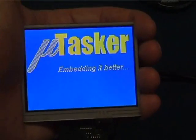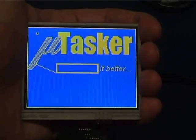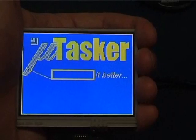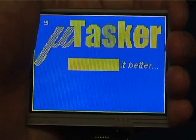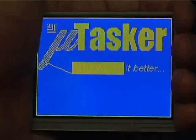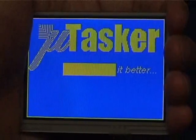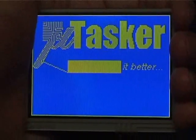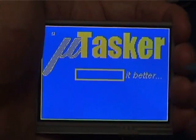Now I'm showing a second mode of operation. The TFT is still being used to emulate a monochrome LCD, but in this case, a group of 4 TFT pixels are being used to display each pixel of the monochrome LCD. The advantage of this mode is the saving in RAM achieved. The original 320x240 pixel demonstration requires a RAM backup buffer of about 9 KB. By grouping the pixels together and effectively reducing the resolution of the display, the savings achieve about 2.5 KB RAM buffer size instead. The touch operation still works.